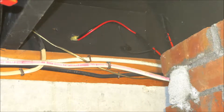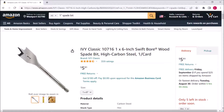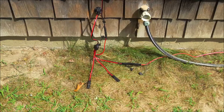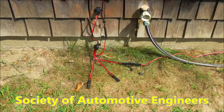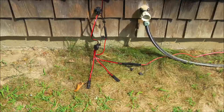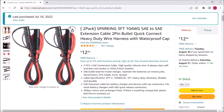So as not to drill into a floor joist, I measured from the outdoor faucet and chose a wide open spot on the band joist. Use a one-inch spade bit to drill the hole. Here's an outside view of my sidewall connector. Laying on the ground is an optional four-way SAE splitter — SAE stands for Society of Automotive Engineers. With one of those, you can easily add up to three more panels to the system. Everything in this upgrade is plug and play. Measure from the sidewall connector to the solar panel — you may or may not need an extension here. Extensions are typically sold in pairs; I needed about six feet, but every install is different.